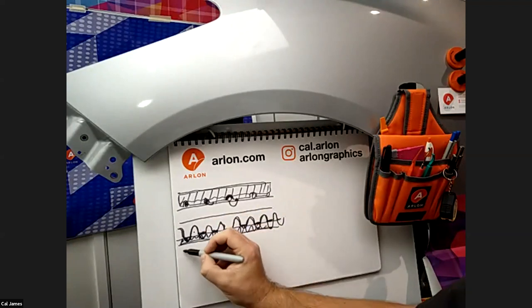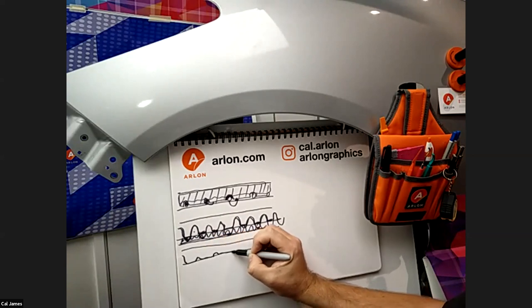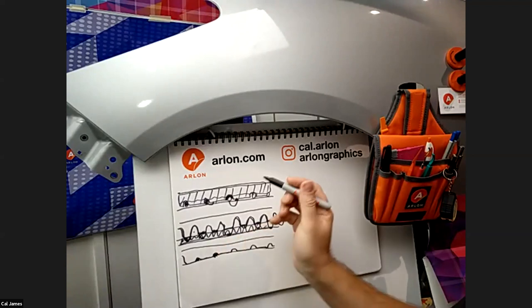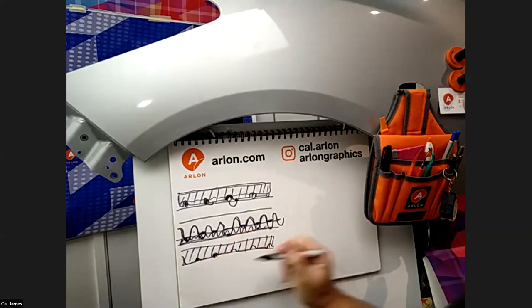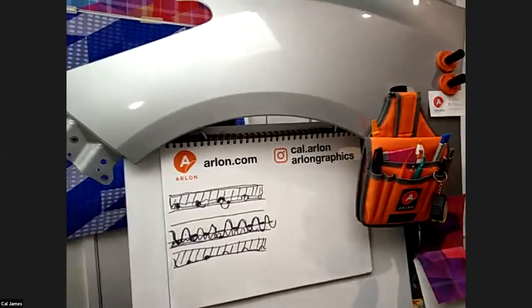As you go along — a few hours later — you'll have mostly coverage, mostly adhesion, with still a few air channels. Once it fully wets out, because all glues are essentially a very thick liquid, it will completely bond. There are no inhibitors in there at all. You've actually got a better contact area than with an inhibitor-based product. The thing I try to remind people is that it's not low-tack — it's low-initial-tack.